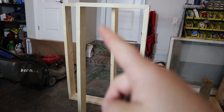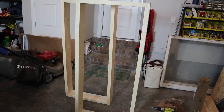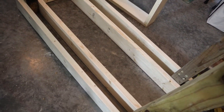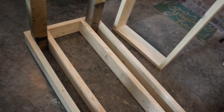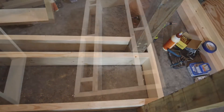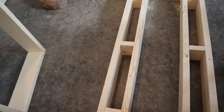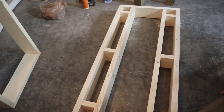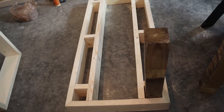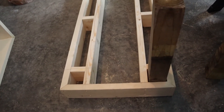For these to actually do anything, I'm going to create some cross supports. We're going to measure down the middle, make some cuts, do the long pieces first, and then come back through and create the side braces. I have cut two of these to length — about 52 and a smidge inches — and persuaded them in. I'm using 4x4 legs so I've used them as stopping blocks to get a really nice tight fit. I've cut in all these little spacers, including one that goes all the way across the middle. The purpose: one is mostly for stability, and the others are to hold the legs. When I'm putting it together I know exactly where the legs go, and then we'll do bolts through each side so they won't be going anywhere.